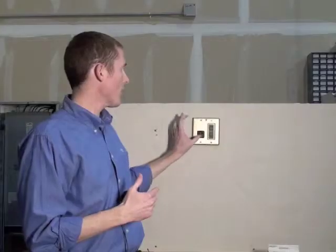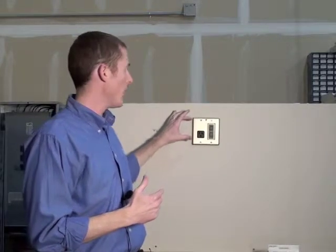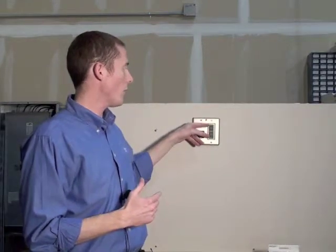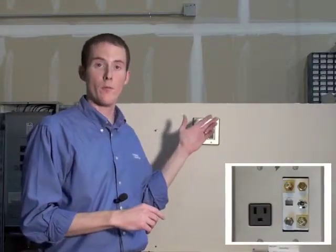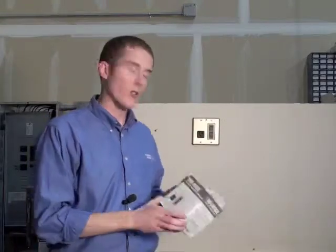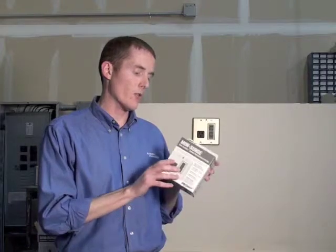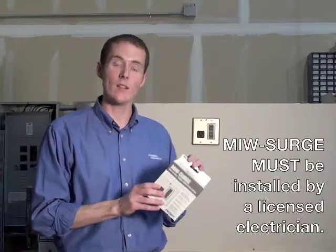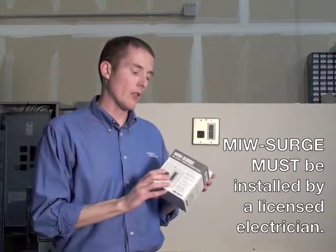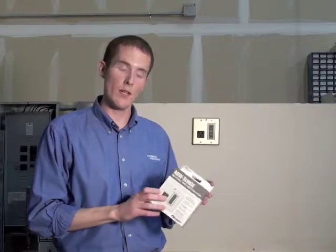On the left here you can see it has a high voltage single gang box behind the wall. We've got a pass-through port for keystone solutions, decor plate options, or just a rubber grommet if you wanted to use the pass-through there. This MIW Surge is part of a two-product family. This particular model features in-wall protection and must be installed by a high voltage licensed electrician. The MIW Surge and XT are both code compliant, CSA US code compliant.